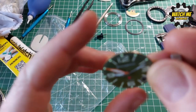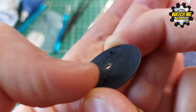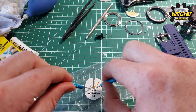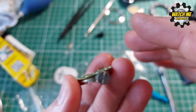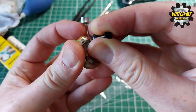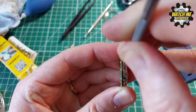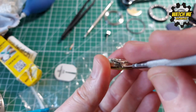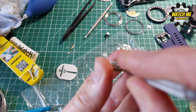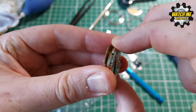With the movement holder not in there, it's easy to see the two screws you need to access with that same one-millimeter screwdriver to undo so you can take the dial off. First there's something in the way — the hands. Here are the feet that those two screws will grip into, so we take the hands off first. I've put this Bergeon dial protector on the dial underneath the hands and then use lever tools to pop them off — so easy. Take the crown back out so it's not in the way, and be fairly quick because if the movement is still ticking you want your hands to line up well. Slacken off the two screws and then there's a bit of leverage to pop out the dial.